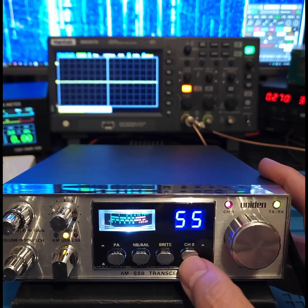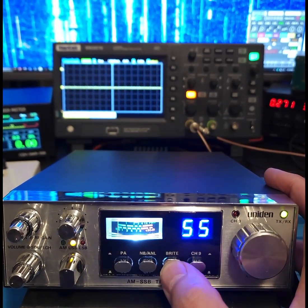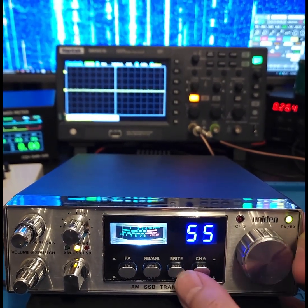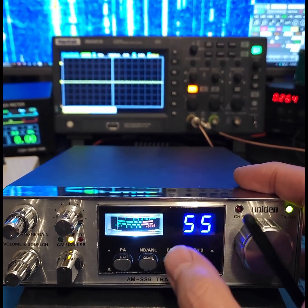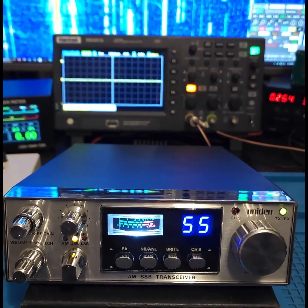So yeah, there's a 5kc drop here, and the bright dim still works. I put an LED behind here, and the micro actually controls the brightness of this, because that I2C chip, you can actually send the brightness in as an instruction as well. So you can turn the brightness up and down with the micro. Yeah, that's about it. I'll show you inside.